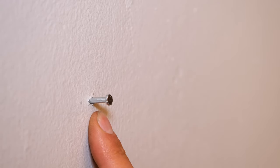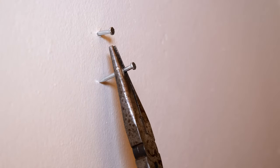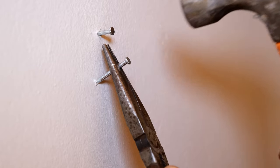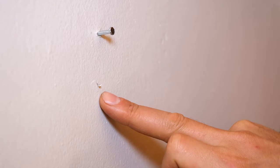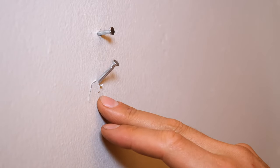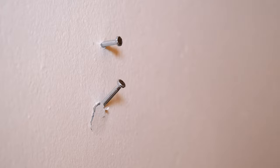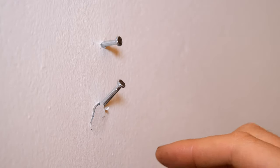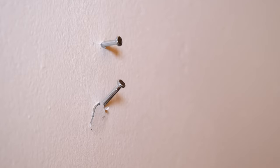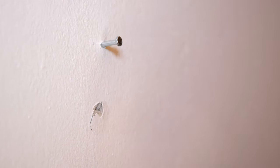There's the finished product. Now I'm going to show you what happens if you hit the nail in at an angle. You can really see the paint is starting to peel and break off, and you can see how it's lifting the cement — actually a piece will come off. You can see how a chunk of cement is coming out. So the point is: if you find you're going skew, stop and redo it rather than trying to fix the alignment while you're hitting the nail in. You can see what a mess that's made.